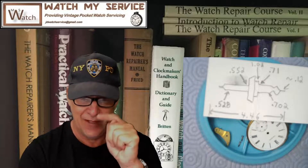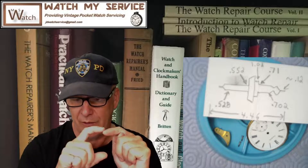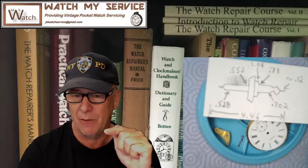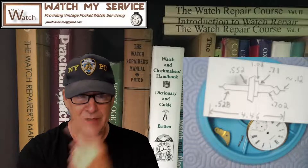That piece of cardboard has enough weight to spin around, so you don't have to stake the balance on and find out nothing fits. If you just put the staff in with the balance cock and upper and lower jewels, you don't really know if it'll rotate freely. The cardboard test takes a few seconds and tells you if the staff is right. I haven't read that in any other book — it's my engineering brain at work. Once you've riveted a balance onto a staff and have to take it off again, there's a real chance of ruining the arms of the balance.